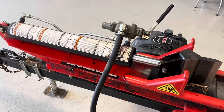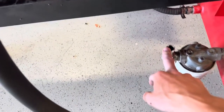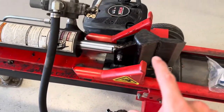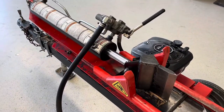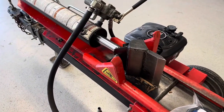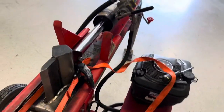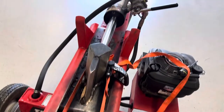What I've done so far: I took off the hydraulic hose from the hydraulic filter and let the pressure run back into the tank and reservoir. Now the idea is to open and close the actual arm so it releases all that pressure back into the line down into the reservoir. Next we'll take the wedge off — I'm still opening the cylinder, getting it out, trying to do it a little easier than pulling it by hand because it still has a lot of pressure in it.